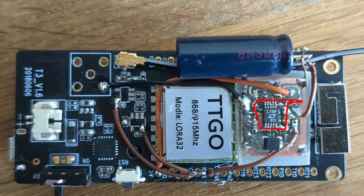I had this chip here — an LTC3440 — which I just had lying around, so I used this. This is a so-called buck-boost converter, which means it can convert up if the battery voltage is below 3.3 volts, and it can convert down if the battery voltage is higher, like 4.2 volts. The output from this I just distribute to these two pins, and that fixes the problem.